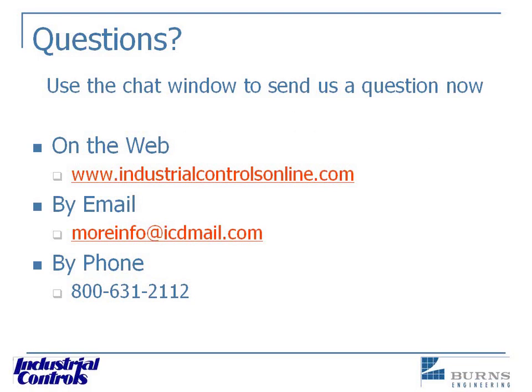Marco asks: how would you test for stray current — can you measure it with a standard electrical multimeter? It typically depends on the electrical system within your factory. I've done troubleshooting where there were ground loops — where the electrical system wasn't all tied back to the same ground — and that can cause a problem especially with thermocouples. Static electricity can also be an issue: blowing dry powder down a pipeline generates static charges and that can cause erratic readings on a thermocouple.